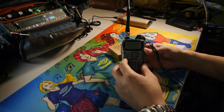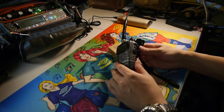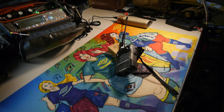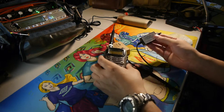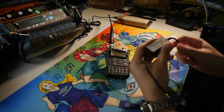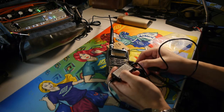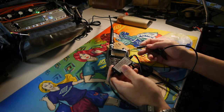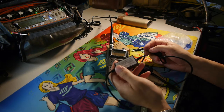I've had this model for about seven years and used it at a variety of ham radio events. I also bought a DC up-converter online — basically it plugs into the DC port of the radio. You plug the other end into a USB power bank and it converts the voltage from 5V to 12V to power the radio. Unfortunately it generates too much RF interference, so you can't really receive or do much while it's running — there's at least a 20-foot radius of RFI emission and it has bad isolation.